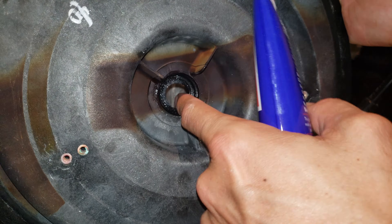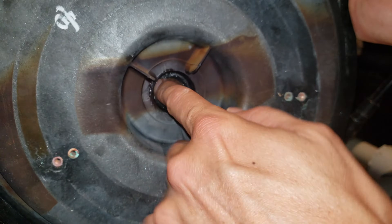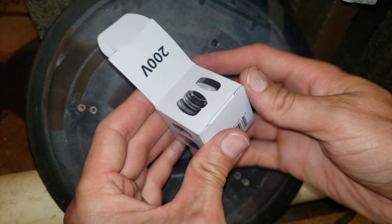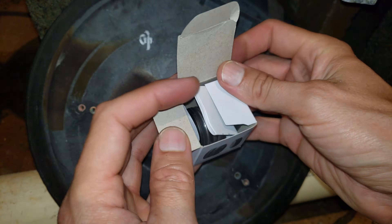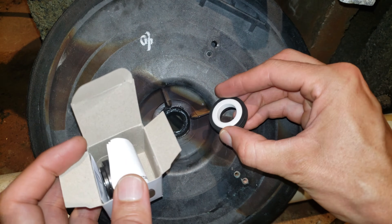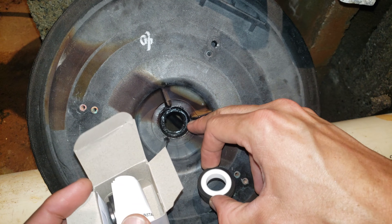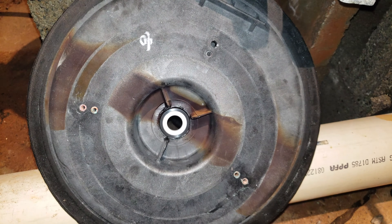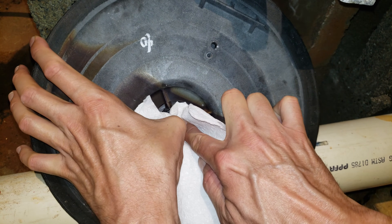But first it's a good idea to apply some of this lubricant in there. These are the new seal parts. The model number for this looks like 200V, with a shaft diameter of 0.625, or 5/8 shaft diameter, and they're designed to fit inside of this Pentair Challenger pump housing. So I'm going to be careful and not touch that ceramic I was talking about - use a paper towel to push it down in there. And it seats perfectly well.